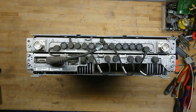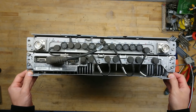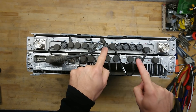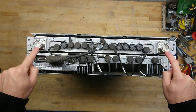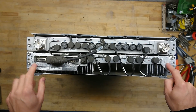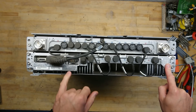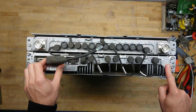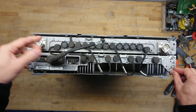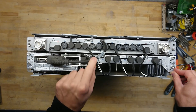The base station that this unit comes from — this is only one third of a whole antenna array. As we can see, it is configured with a transmit A connection and a receive A, a transmission B and a receive B, and then antenna B and A. There's a control bus connection down here at the amplifier module. The power input is also down here, so I assume either there is some connection between the two modules for the power, or maybe the duplexer only has a few measurement capabilities that go through this signal cable.